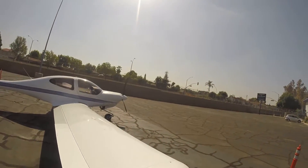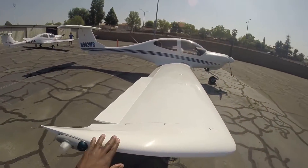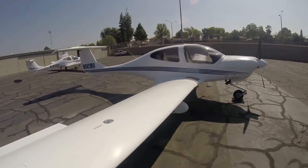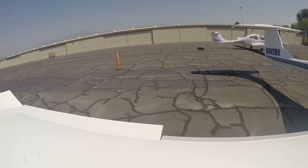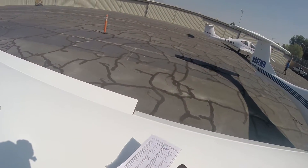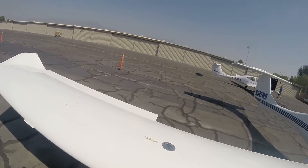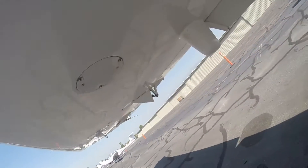Check the wing surface here too. Check the wing tip — all good on the side. The stall strips again — there and there, they're there. The tank filler — check this side as well. Open it up — all good, some fuel in there. Close it back. Again, check for your fuel vents — right there and right there, they're good and they're clear.